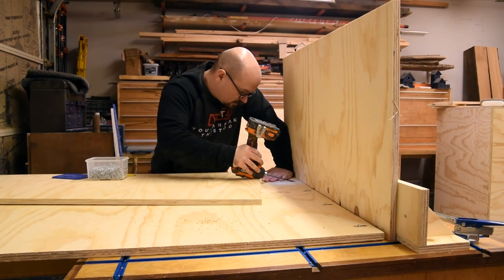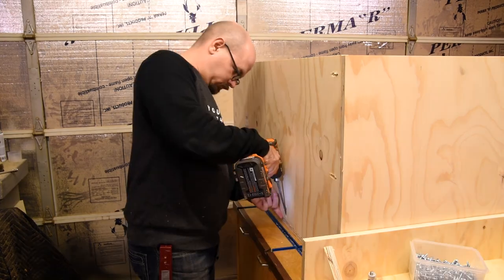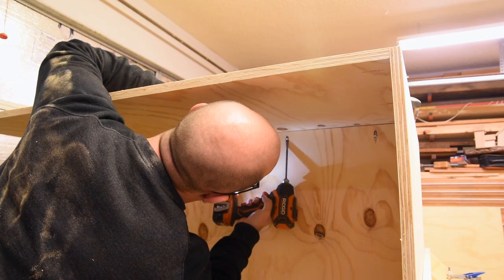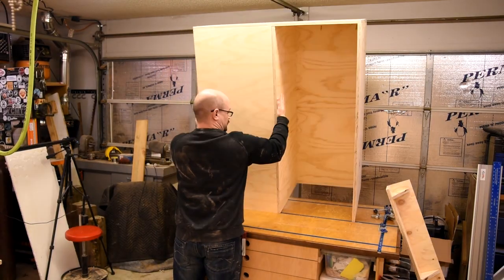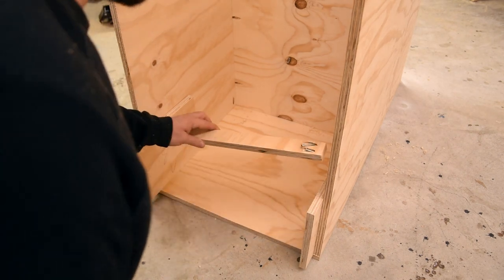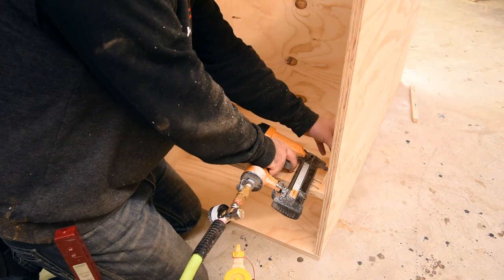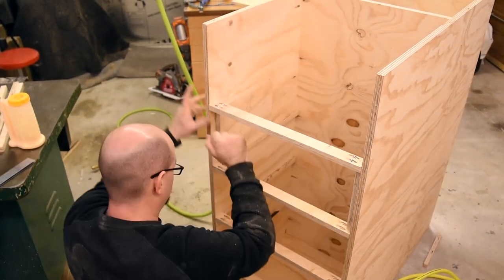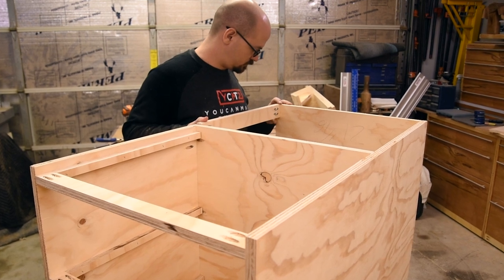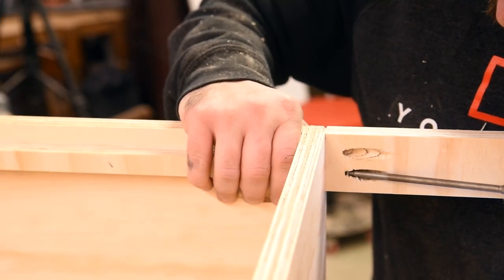After the bookshelf assembly is together, I switch to putting together the structure of the drawer and closet combination. The drawers are all just going to run on wood runners. I make these and the dividers from more three-quarter inch plywood and again use spacers to keep everything equally spaced. The front dividers get pocket screwed into place, and the runners I just use wood glue and staple into place. I also added a spacer to the bottom of the closet opening to pull it back into square.